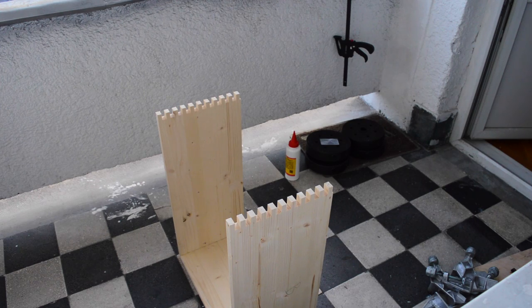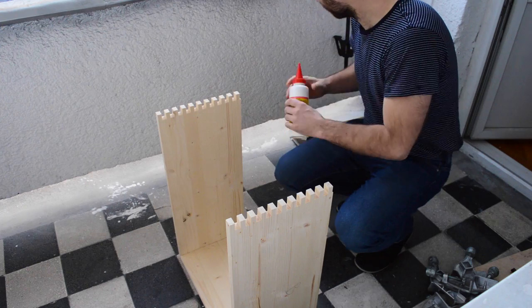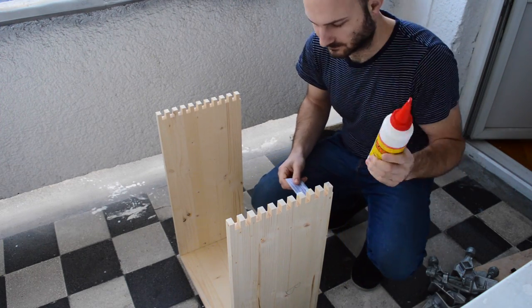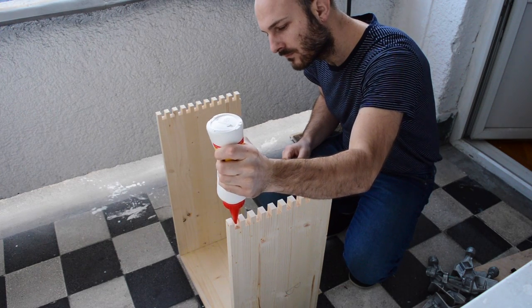Since I don't have that option, I've decided to glue the box in two steps. The first step is to lay the box on the narrower side and leave out only the top side. Then apply wood glue or any other similar glue and use an old credit card or similar plastic card to spread the glue evenly in thin layers.